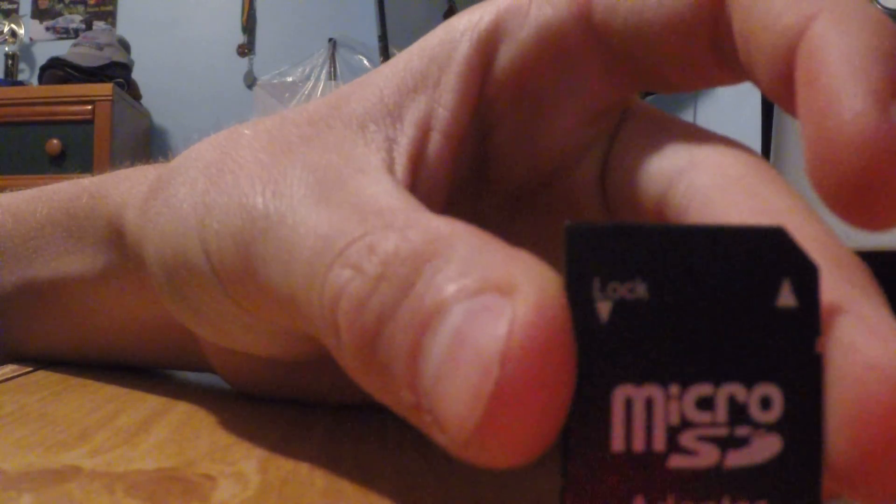I've had these problems a lot of times. The biggest problem is your SD card. You think, let me just go on eBay and order a cheap one — a generic one that looks like this, or like this. Well, these ones are good for a phone, not a Raspberry Pi, because most likely they're not compatible with Linux. You'll always want an SD card that's compatible with Linux.